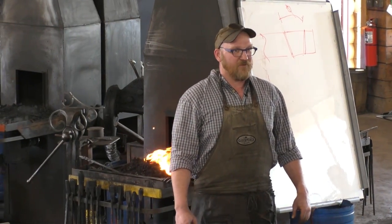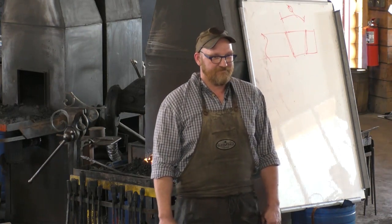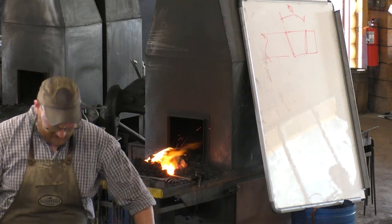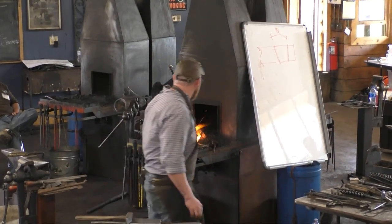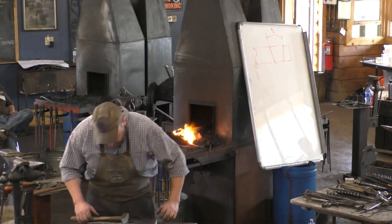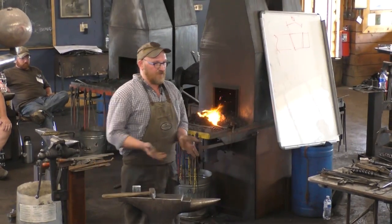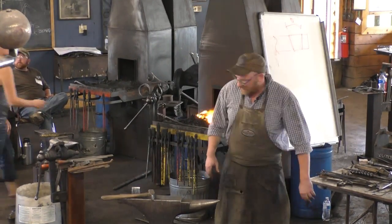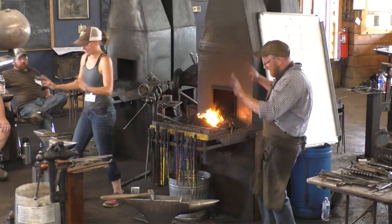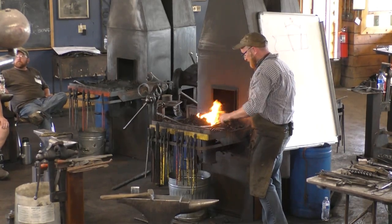Anyone know why I bother doing the steps? Bends where it's the weakest, which is the thinnest or the hottest. Yep. Just helps it bend where I want it to bend. And the idea and intent of it was to have fairly square or fulfilled corners. I didn't want too many round corners on it, so this made life a little bit easier. And I'm not going on a diatribe this time. Not this time, maybe next time.